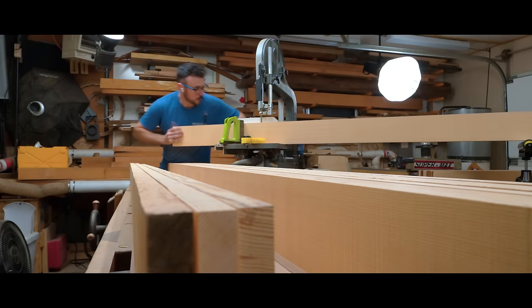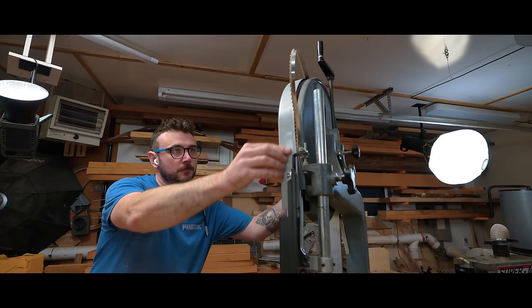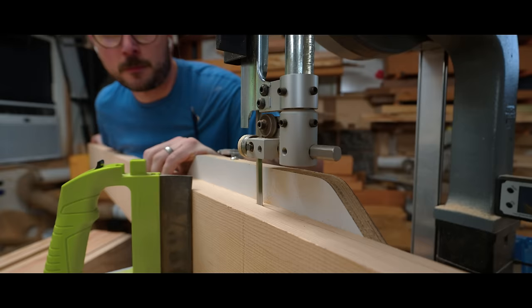Now, the first thing I need to do is to take all of these 2-inch thick boards and turn them into a huge pile of 1/2-inch thick boards. Snapped. The extra resin content produces a lot of frictional heat, resulting in a lot of snapped blades.